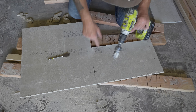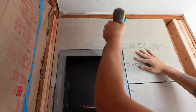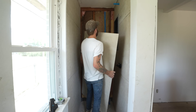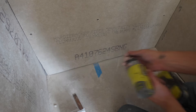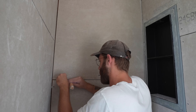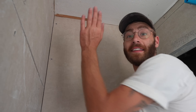A carbide or diamond-tipped hole saw is great for the shower outlet, but you could also use a spade bit. I used an inch and a half hole saw and that's plenty of room for the shower arm to thread through — anything bigger really is unnecessary. I used more cut-off material to finish up this wall, then moved to the back. Using a tall piece should help us stagger our seams, which helps prevent any cracks or shifting over time. I used blue tape on the mortar bed to mark the stud location since I wouldn't be able to see them. That's boards up!